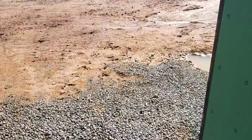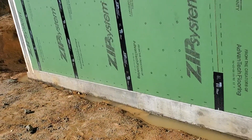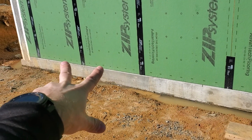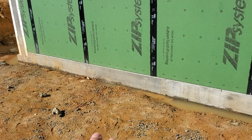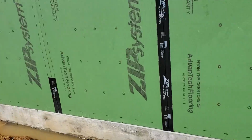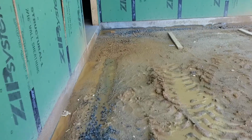One thing I'll show you real quick, if you walk around the corner, this is where the units will be going. We will need to get with Benji Schmidt, the contractor, to figure out exactly where the line set and drains need to come out at what level, because we don't know what the finished grade will be yet and what height they're going to pour the concrete. They're probably going to pour concrete for outdoor units here. Actually, that's almost pretty much a given at this point.